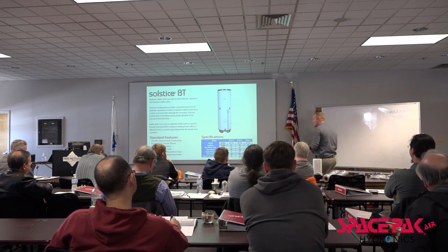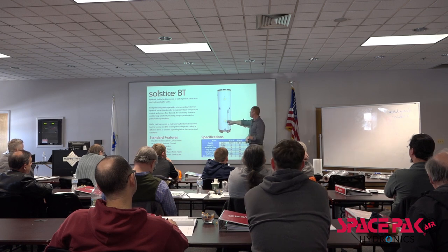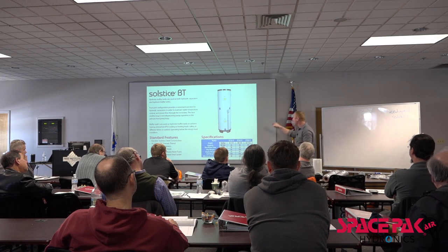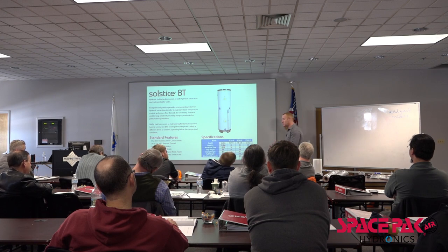Stainless steel buffer tanks, our sizes are 26, 40, and 80 gallon. They're a completely empty four-pipe buffer tank. But what do they also have? Two immersion well elements in it. So what did I say? Sometimes things get too cold outside and the heat pumps can't quite keep up. If the water temperature drops below a predetermined amount, it will automatically power those elements, and add the potential of another 20,000 BTUs back to that tank.